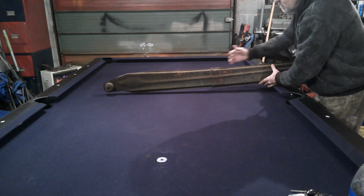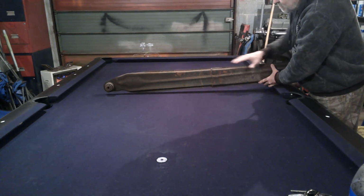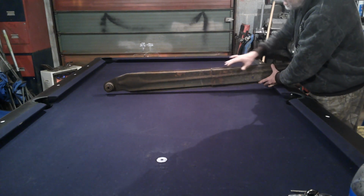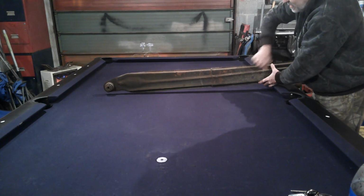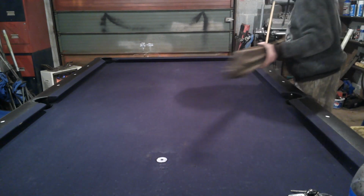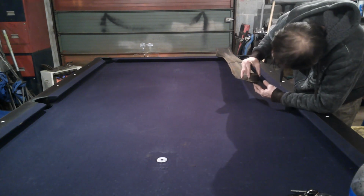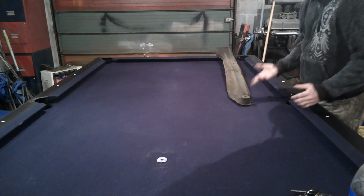So if you ever do a butt joint, well, I'm not very good at it, but when you weld them together, you always put a plate on the inside or the outside. It makes it even stronger. But this way, when they cut it and slit it, see, it's double thickness here. And that is solid metal. The only thing it might need changed, it looks like, is the bushing. But that bushing is good enough for me for mock-up right now.